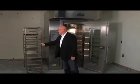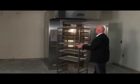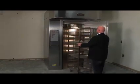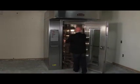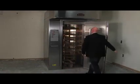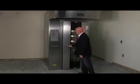Roll the rack into the oven. The oven's carrier will slide into the rack's lift channels. If a rack has pan stops, load the rack so the stops will prevent trays from moving toward the user as the rack is unloaded. Finally, close the loading door. The rack carrier will lift and rotate only during a timed bake.